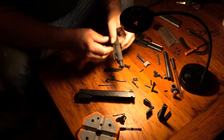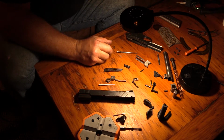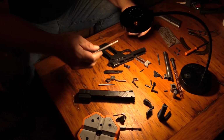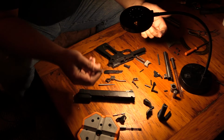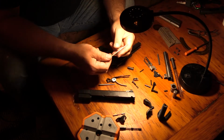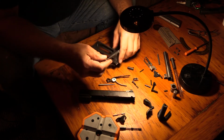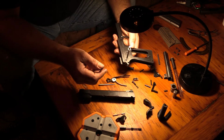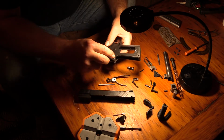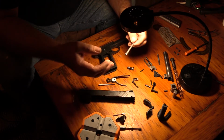Now something else that's kind of interesting, I got an AR-15 bolt carrier group here, that firing pin. When Eugene Stoner designed the M16 AR-15, he was marketing it to the military, or wanted to, and the current sidearm at the time was the 1911 A1. So if you notice, on all AR-15 firing pins I've ever seen, there's two different radiuses. Well, that first radius is the exact same size as your sear pin, and that second radius is the exact same size as your hammer pin. So your AR-15 firing pin is actually an armorer's tool, and that is actually by design.